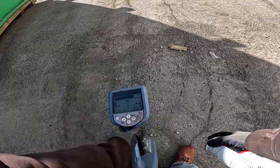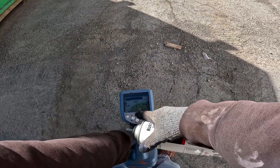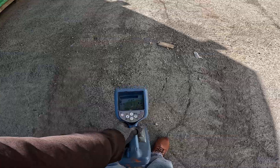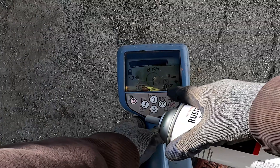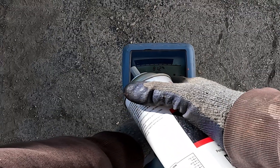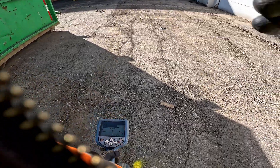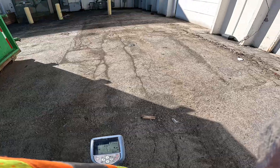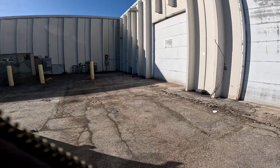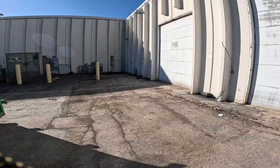Look at that — it went right off the chart, right there off the bat. Told you — great continuity. I'm going to put my dot right here. I'm getting 108 milliamps and I'm at three feet depth. My peak graph is beautiful and my compass arrow agrees with that service. That's my first tone.